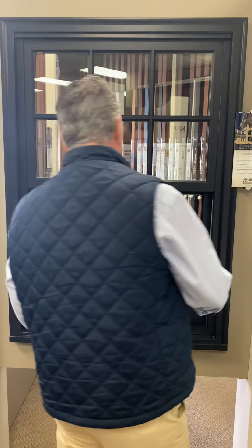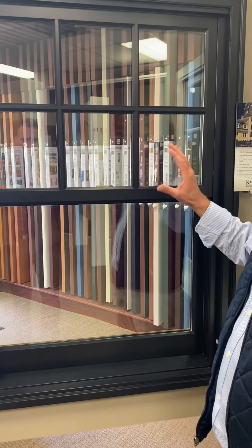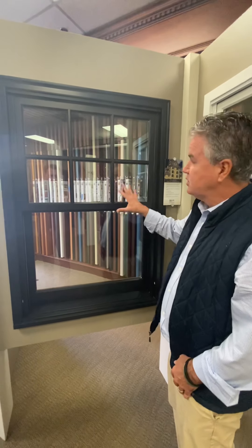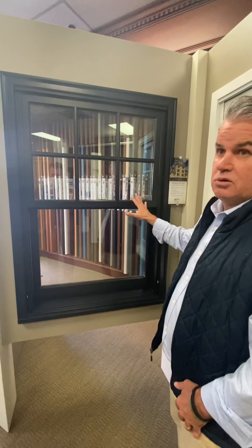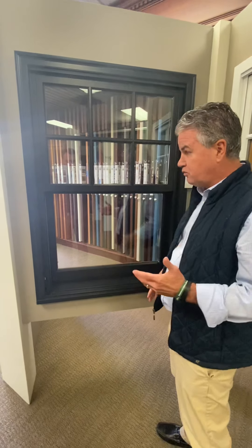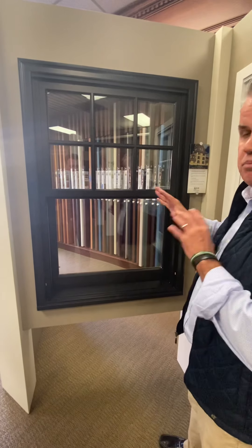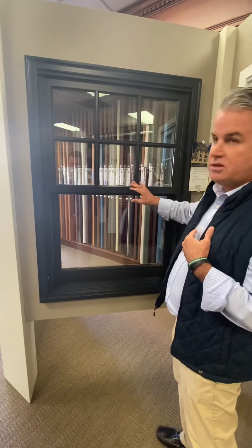To the exterior, it's extruded aluminum. Colby uses a 2605 paint specification — most manufacturers use a 2604. We do not charge for the upgrade. The 2605 allows for a 30-year exterior warranty versus the standard 20-year. Both the sash and frame are extruded, so we don't mix metal types.